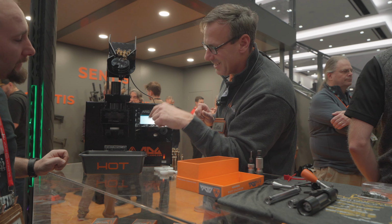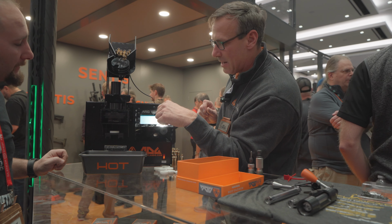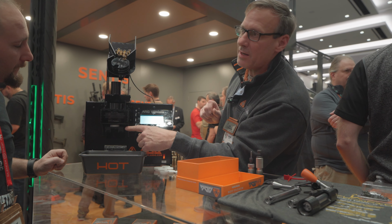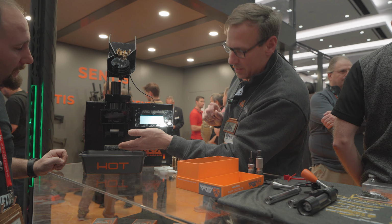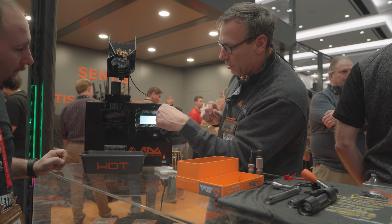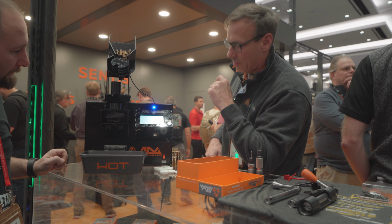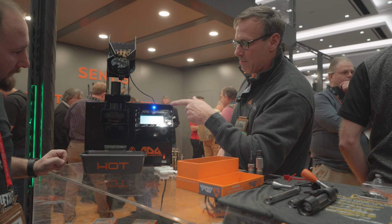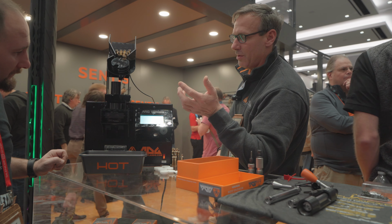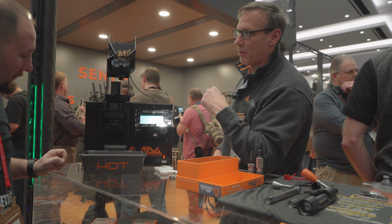Okay. So I come back here, go to my normal again from the main menu. It's going to reset the height on the table, so it went down to 0, and then it came back up, and then I'm ready to go. I can turn the feeder on, and I can hit auto start, and at this point, it's going to drop the brass in, preheat to 200 degrees, and then it does the anneal, and then drops it out annealed, and goes to the next piece.